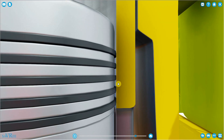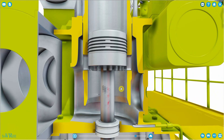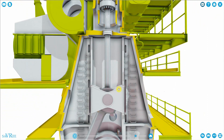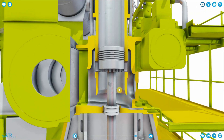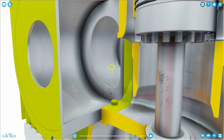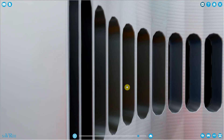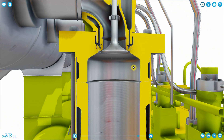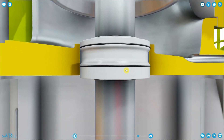You can see here the piston rings — they press against the cylinder. There's a thin film of oil between the rings and the cylinder liner. If there's any misalignment, for example if we had a very large connecting rod, we wouldn't get a good seal. Another reason to have this design is because it allows us to separate the crankcase from the scavenge space, which is where scavenge air flows into the cylinder. We don't want scavenge air going into the crankcase, so we install a stuffing box.